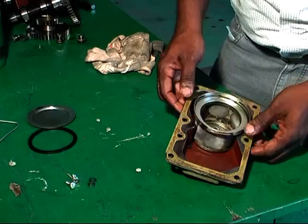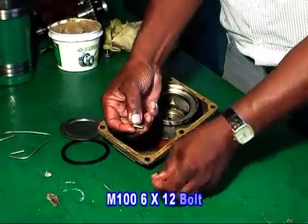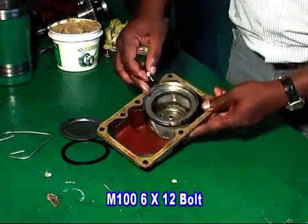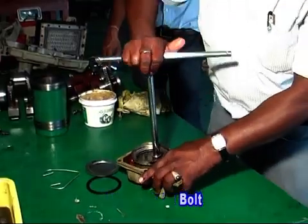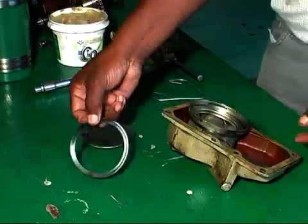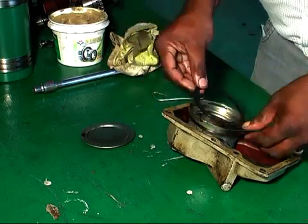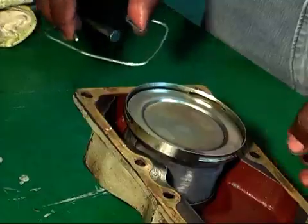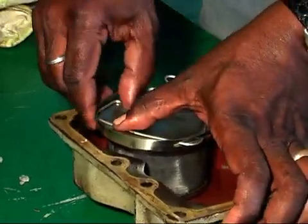After cleaning the oil screen, match two number 612 bolts into the hole of the oil pan and tighten them with spring washer. Then cover it with an O-ring. Apply a lock wire to fix the cover as the cover becomes tight.